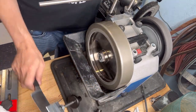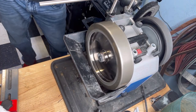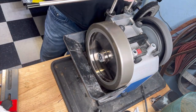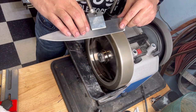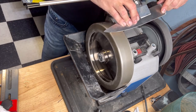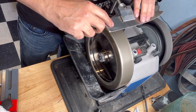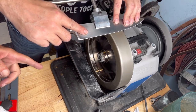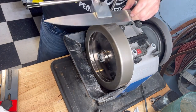Some guys call me and say, "Oh, my wheel doesn't fit on the shaft, it goes only over the turn, and then it's finished." Most of the time they have a brand new machine, and the manufacturer puts some wax on the shaft. If there is wax on the shaft or it's dirty, you have to clean the shaft. Best you do it with sandpaper, because this is a stainless steel shaft. Nothing happens, and if you remove a few hundredths of a millimeter, it will go fine.